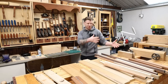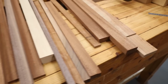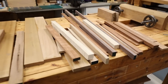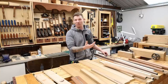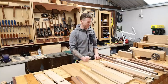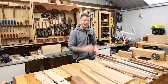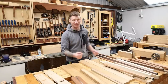This is what we're working with — just various off-cuts, trying to use up some scrap wood. Going to do this as quickly as possible; everything is going to be done on the table saw. We're going to start ripping stuff down to roughly 18 by 18 millimeters. Most of these are about 18mm in thickness, so the squares will end up 18 by 18. Rip it all through the table saw, glue it up, slice it up, and make ourselves some end grain coasters.